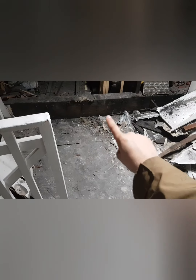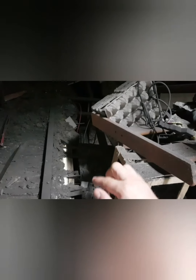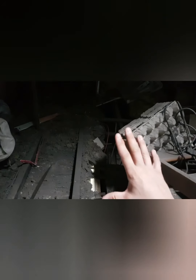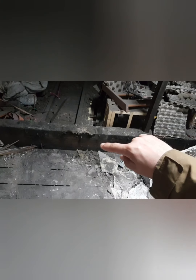So that's problem one. Problem two: this existing loft conversion - because all this wooden cladding was on both sides, we've ripped that off and found the loft conversion was only finished partway; they haven't gone all the way across. These are the existing joists for the ceiling below and you can see all the old lath and plaster. We've dropped our ceilings below and put acoustic mineral wool in and plastered, but that's not the point. We want to extend this loft to give that amazing feel of a big bedroom. We're getting advice, but here we've got to put a steel in, put joist hangers off the steel, probably put wooden noggings in - either way we've got to get some new joists from over there to here.